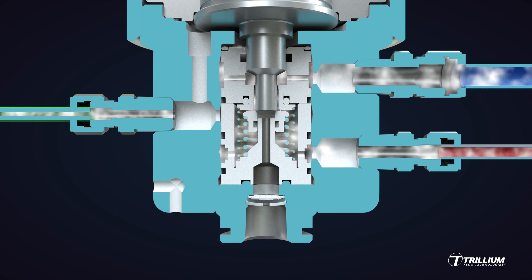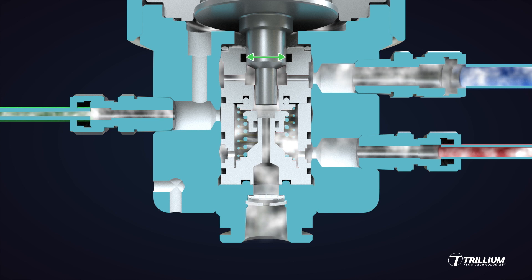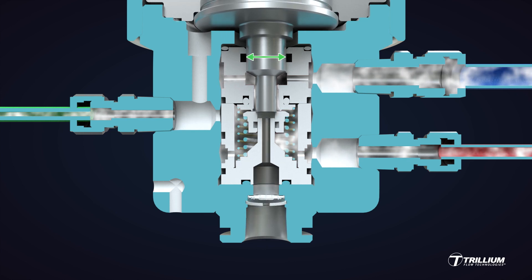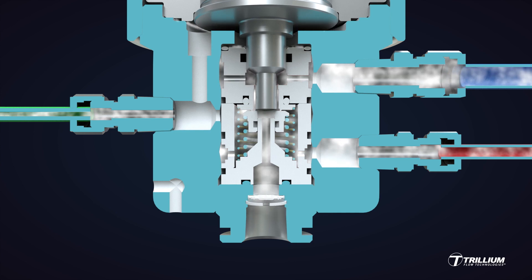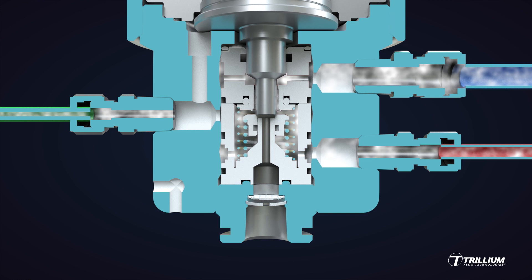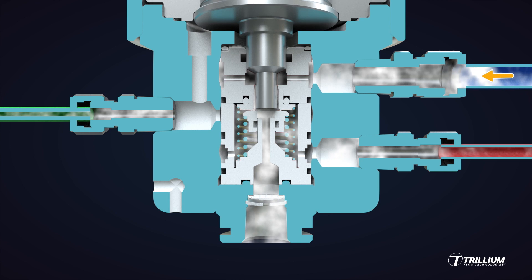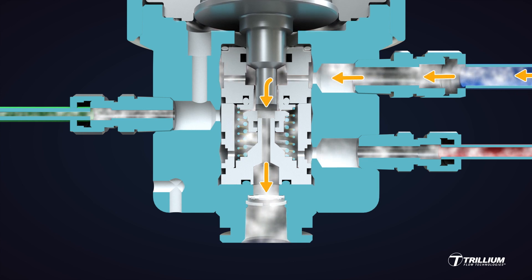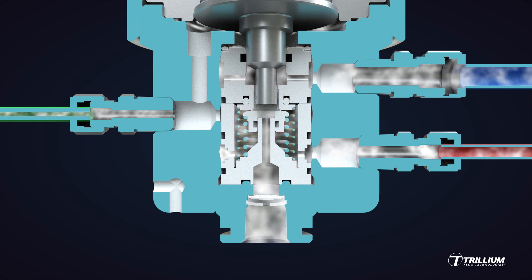In the DMS pilot, the drain spindle upper diameter is expressly increased to provide modulation. The forces which are generated in the pilot from the dome pressure cause movement of the drain spindle, which engages and disengages the fluid in the exhaust nozzle. The drain spindle design is adapted to meet the dome chamber volume to be vented. At 10% overpressure, the pilot reduces the dome pressure to zero. The main valve is now in the fully open position.